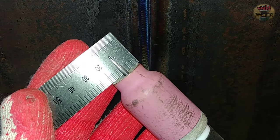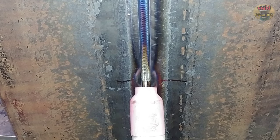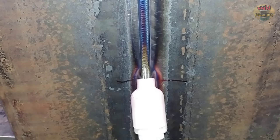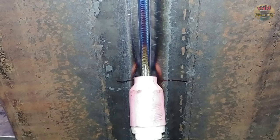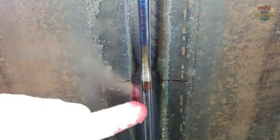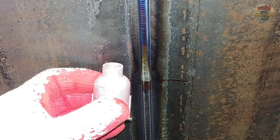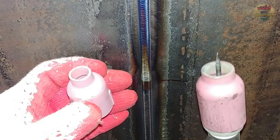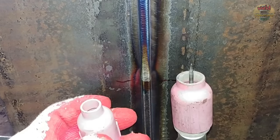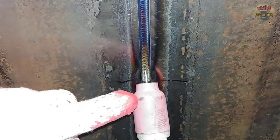This is the result. As I showed you, if you use a large nozzle it is difficult to control the torch compared to a small nozzle. However, if you weld with the same amount of deposit, the larger nozzle will have better shield gas coverage. If you weld with a small nozzle, it is easier to control, and you can achieve a faster weld speed. If the speed is faster, you can reduce the heat input as much as possible.